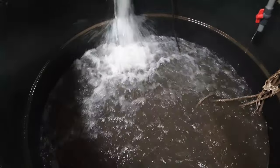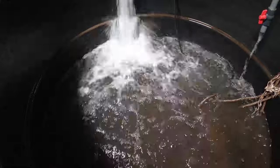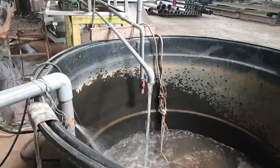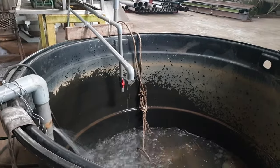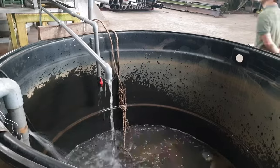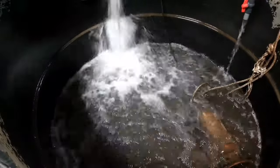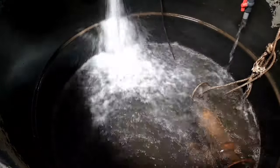The water coming back on top is actually a recycle line, because the pump we're using is a 20 cubic meter pump, much bigger than the required specification. You can see the water has started to clear after only about 20 to 30 minutes. Here's another time lapse view of the influent tank — this is where we mixed all the dirt. You can see some of it is still floating on top and hopefully gets removed over time. In this experiment we only ran it for about 2 hours, though we could have run it longer. Finally, from the top view, you can see the water starts to clear up after some time, which is indicative of how well the DAF is removing the dirt, as the amount of solids in the system is being reduced over time.